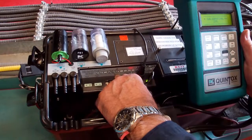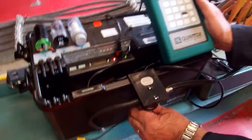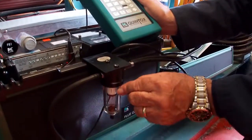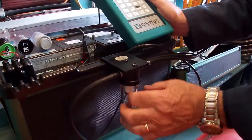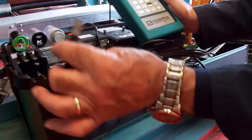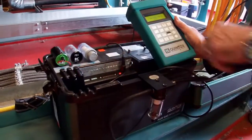It's about $5,000 worth of parts. Over to the side here there is a coalescing filter. Flue gas comes down this hose, which is connected up at the probe at the top, and it drops the water out so you get just a dry sample going into the actual analyzer itself.